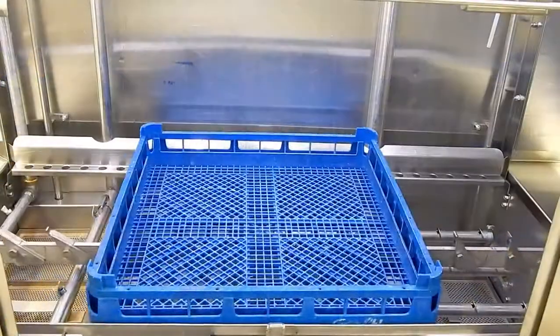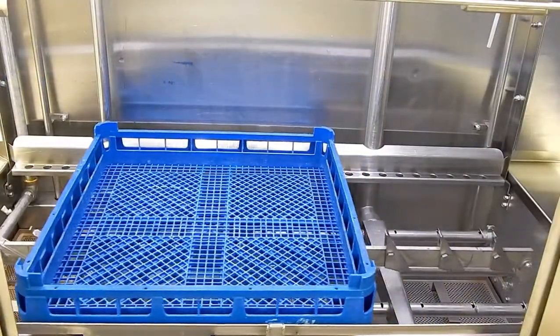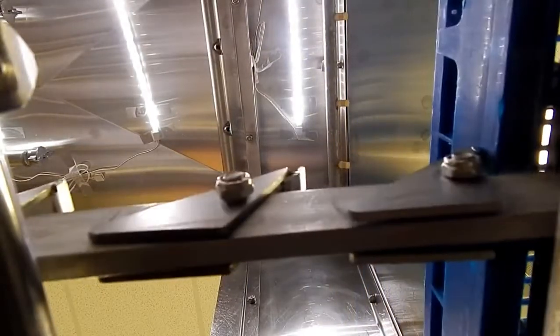The dogs need to move freely. As it enters into the rinse area, the two dogs on the very end of the conveyor bar are called exit dogs. They are longer and extend out further. They are designed to push the rack to the end of the conveyor and to exit out of it so that the system can turn off when no more racks are in.